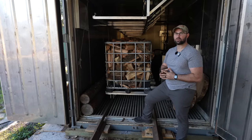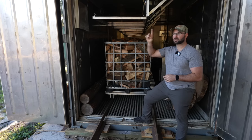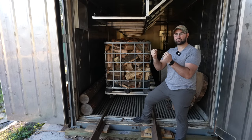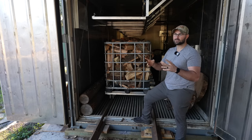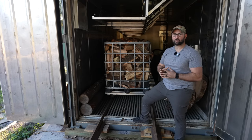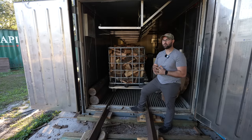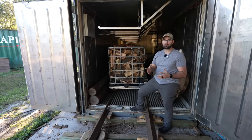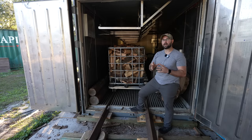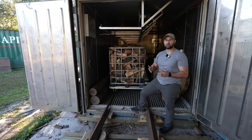On this Nile L200 Pro unit it has another mode called hybrid mode. In that mode, it uses the vents on the side of the kiln and pumps the moisture out through those vents constantly. At the same time it's using the compressor to suck that moisture and pump it outside of the kiln — so it's like a dual action where it's pushing moisture out the vents, sucking moisture out through the compressor, and drying that firewood even faster. When we start the firewood drying process, for the first couple days we put it in hybrid mode because as it starts to heat up to 130 degrees it fills the kiln with so much moisture that sometimes the compressor can't keep up. In hybrid mode it sends half that moisture out the vents and the other half through the compressor and into a bucket on the back of the kiln.